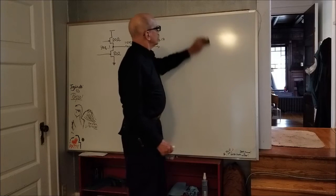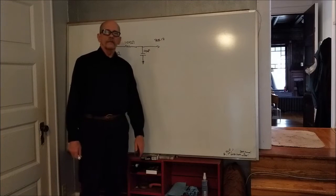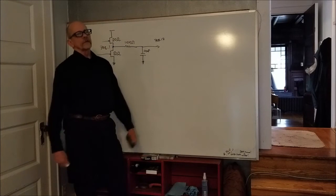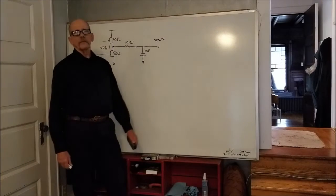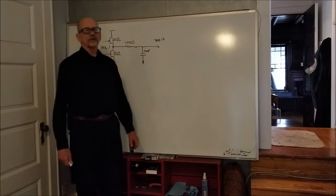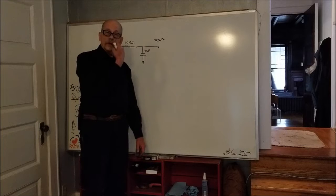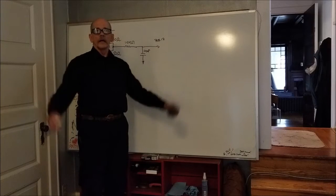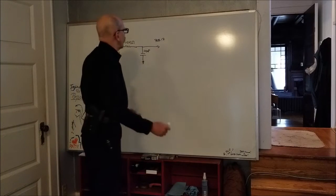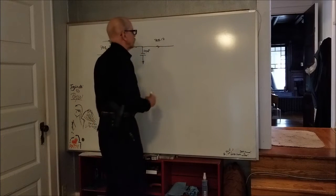And we looked at the nice friendly Keithley, and it said that we were burning about 70 microamps, not 2 or 3. What the heck? The leakage of this particular chip was running about 13 microamps. So we were looking at a fairly substantial, like nearly 60 microamp cost to running that little oscillation of the RC in between the switching thresholds. Why? Ha! TANSTAAFL forgot that it is not without cost to perceive things that move slowly in our chip.